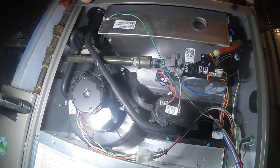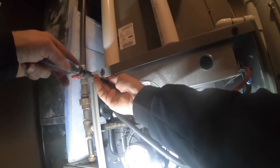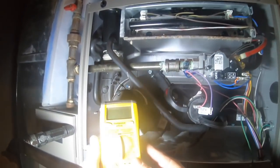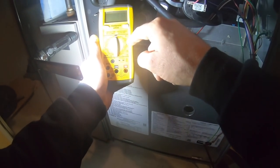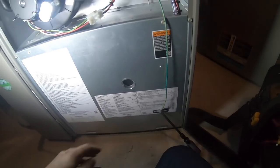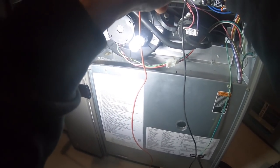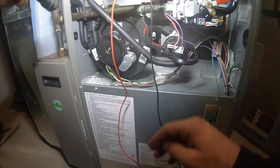There's that. Now, there's one thing to address here. This meter, when I was testing at York, was in the U, which is UA, MA. I was in the U. Someone's trying to tell me that I don't know how to test the flame sensor. I'm doing it all wrong. MA does not mean UA, it just means that's where I can test from. UA is where I'm testing from.